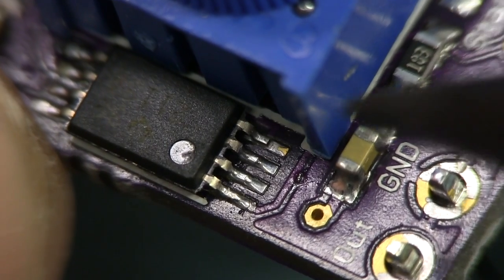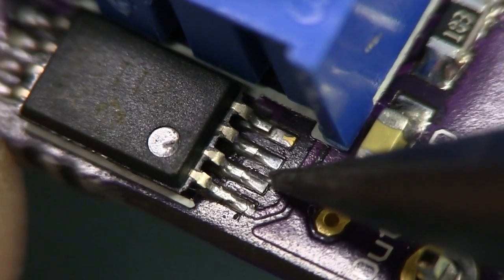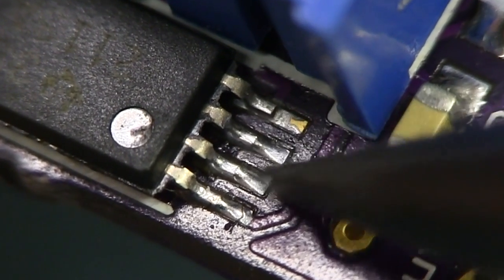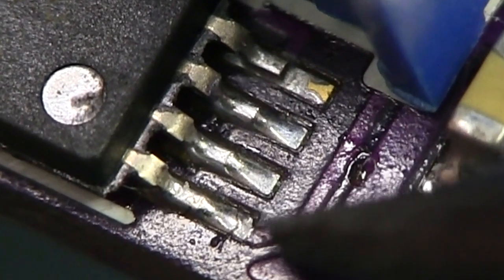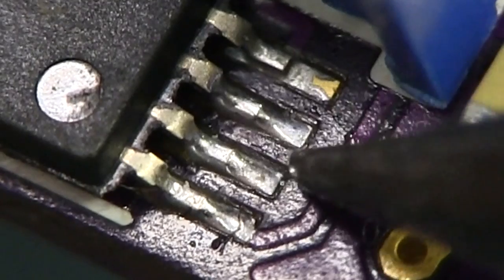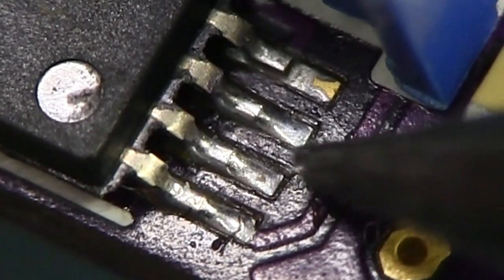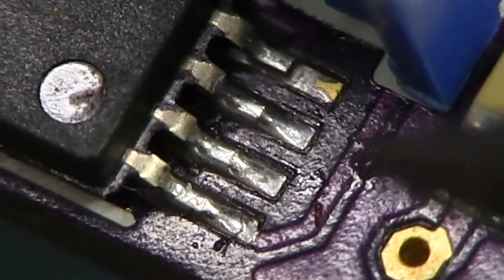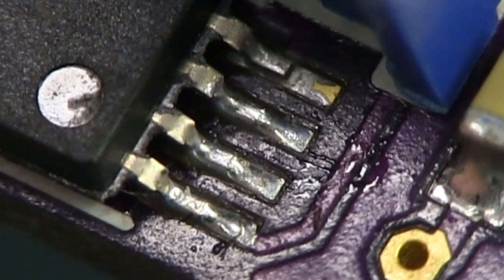And the other good thing is that on your layout here, you have got solder mask between your individual pads in there. That's a big beginner mistake. A lot of beginners, the solder mask expansion is too big and they don't have any solder mask between there, or it's so very thin that the manufacturers can't actually manufacture it properly, and then you can get solder bridges and stuff between there. So excellent work on the solder mask expansion there.